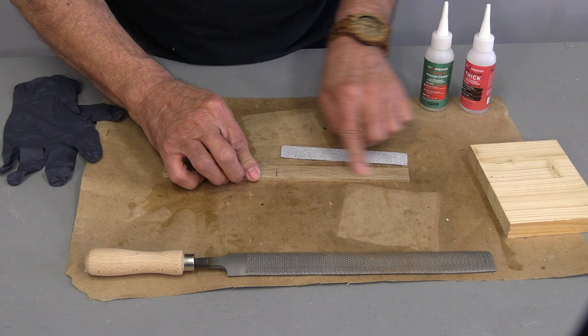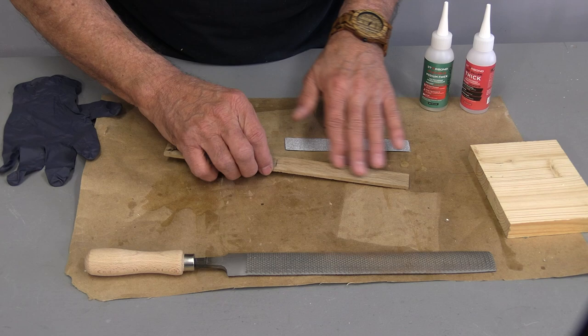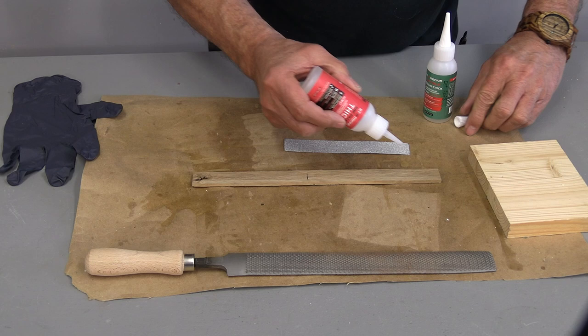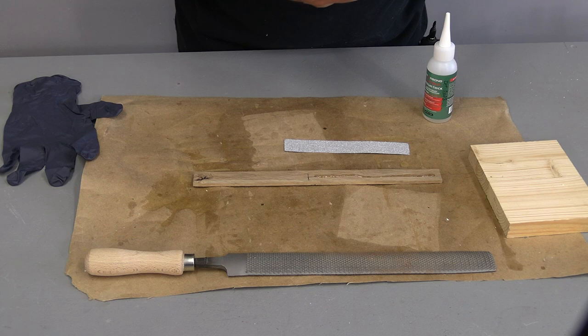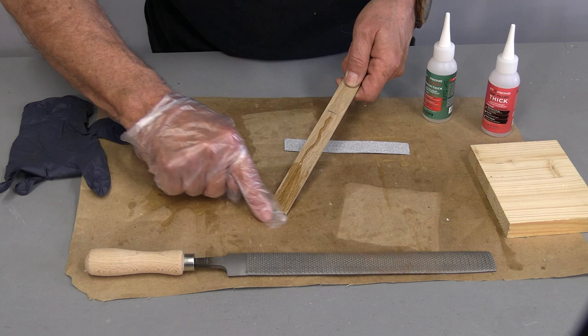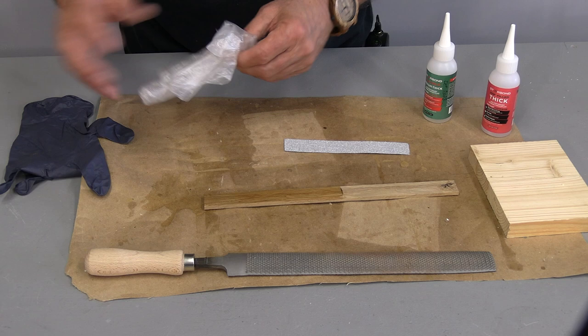You've probably heard of applying double-sided tape and then putting sandpaper on there. That doesn't work because the double-sided tape does not withstand the pressure of sanding. So what we're going to do today — you could use a thick or a medium for this — I'm going to use the thick glue. I'll put a bead of glue along there up to a mark I've made on the wood. I'm using polyethylene gloves — these are CA safe; you can't use vinyl gloves with CA glue. I'm just going to spread that thick glue along there with my finger, and because it's thick it doesn't dry right away.